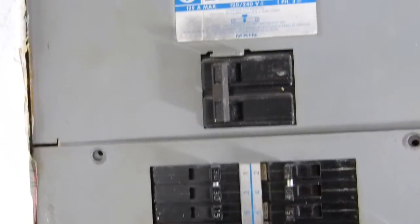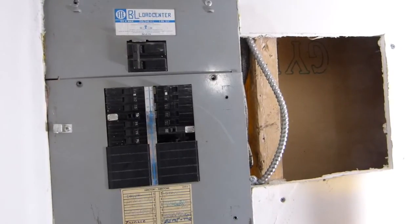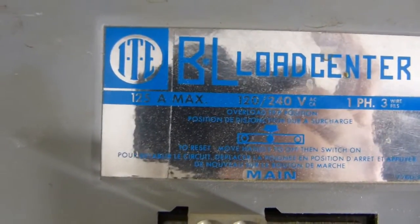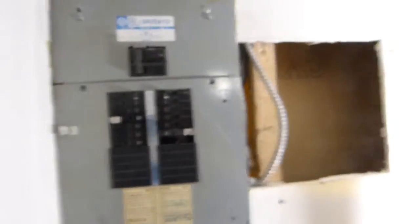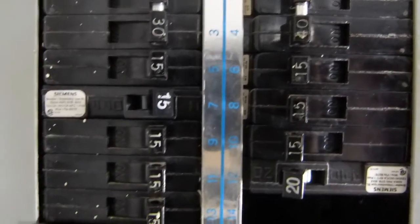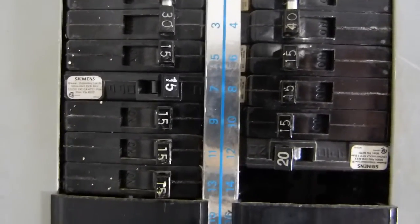First thing: how is the paint? Are there any scratch marks on the paint — anything that tells you it's been dropped, bent, or worked on? Are there any screws missing? How is the paint fading and color — is it consistent with the nameplate and the age of the building? In this case, this is a 1971 building with a 1971 breaker panel and fading that looks like 1971. When you look at the breakers themselves, you have a 30-amp breaker for the dryer, a 40-amp breaker for the range. Everything else should be 15-amp breakers, and all should be consistently the same plastic with the same age.